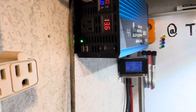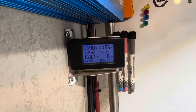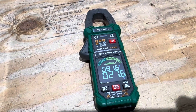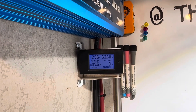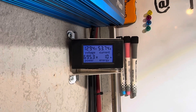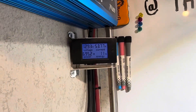Now I'll apply the load to the HiSincere battery. It is a battery charger charging another battery. We'll let that settle in and get a final current and wattage reading. The battery's still at 13.47 volts as the load's picking up, dropping to 13.4 there. Battery temperature at the start of the test is 81.6 degrees Fahrenheit or 27.6 Celsius. Recording the load for the duration of the capacity test: 53.7 amps, 695.8 watts, 12.94 volts — about 13 volts right there at the start of the test.